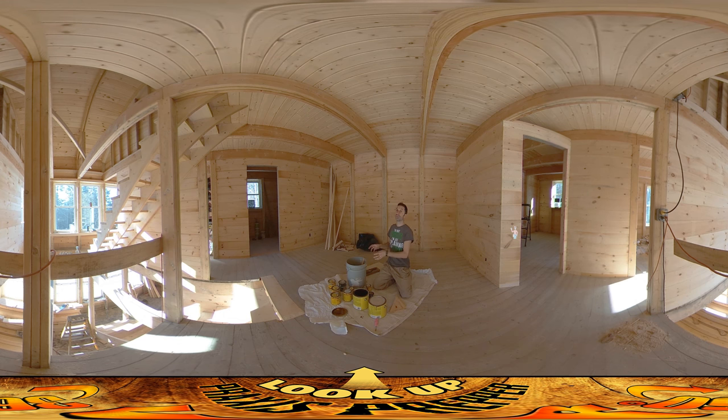Once I create this mix, it's going to be used for the floor joists and the collar ties upstairs. I haven't decided whether I'm going to stain the posts yet — I'm kind of leaning away from it, but I need to see how it all works together. I'm mixing up way more than I need for that, but the idea is that once I finish, I'll take this stain, add some darker colors, and use it as a different color for the floor. Dark floors will help absorb heat from the sun coming through the windows, so this stain is going to have two incarnations of color.